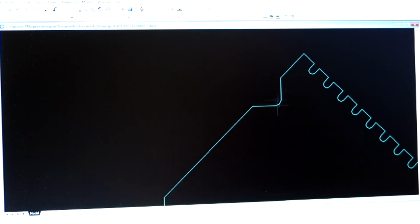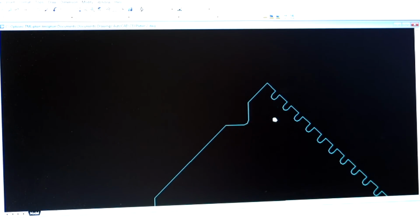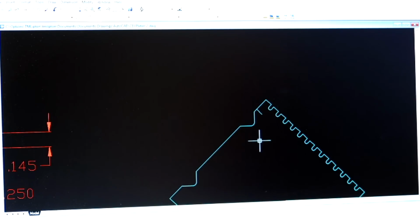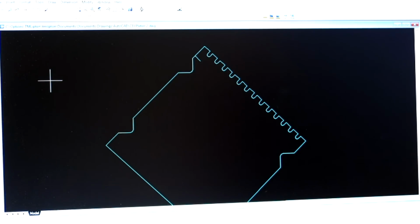So we took some measurements to this smaller pin. Okay, so what we're going to do, you know what, let me back up there. I'm going to place the 1/4 inch pin to the dimensions that we measured the 1/4 inch pin to. So I'm going to do a little offset, and that number is, let's see, 0.134. Enter. So I'm going to offset this. This is the surface we're measuring from. And then I'm going to offset this other surface that we were measuring from. Offset 1.605. So all I'm doing here, guys, is saving myself some math. So there we go.